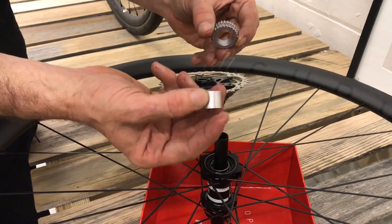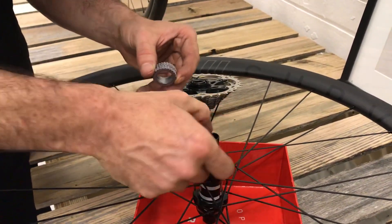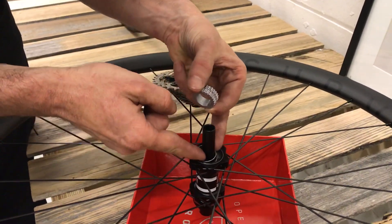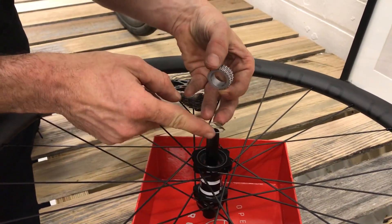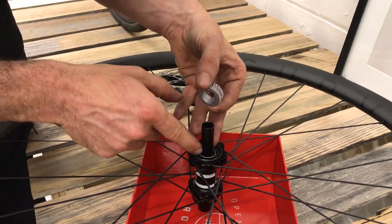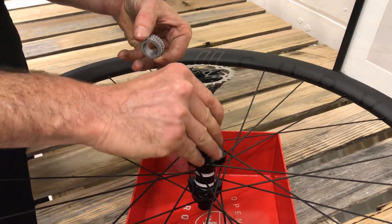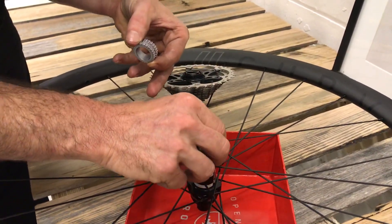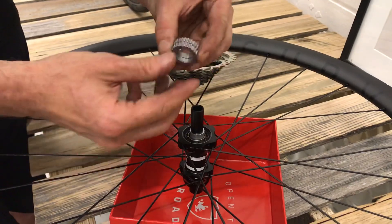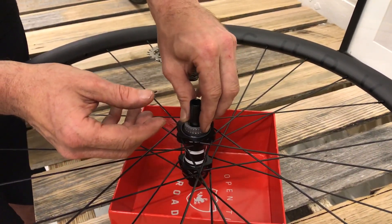There's a little piece for the axle just to get everything nice and snug, and then as you can see in here there's another spring. Two springs again — conical, facing each other from the pointy end. That goes back in here and I'll get that back in nice and snug, making sure that the ratchets are actually engaging.